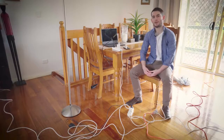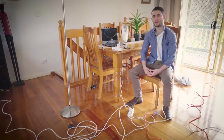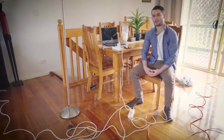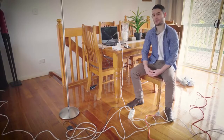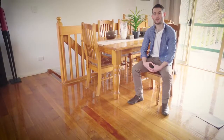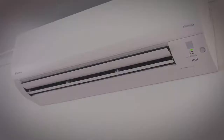So why would you use a manual transfer switch? Well, without one, if you've got a generator you can always run an extension cord into the house and power portable lights, appliances, power boards and extension cords. But things can quickly become complicated and potentially dangerous with things lying around all over the place. But when you add a manual transfer switch, all you have to do is plug in the generator to a single outlet outside the house, and then you'll have fixed lighting, power outlets and all your appliances as normal, including hot water units and air conditioners.